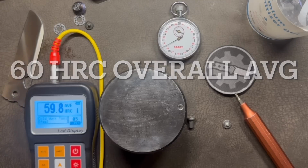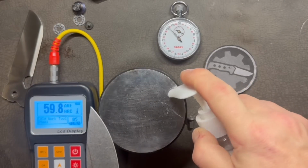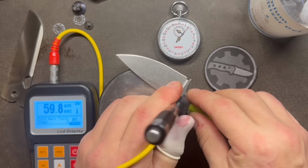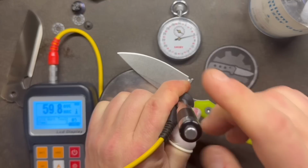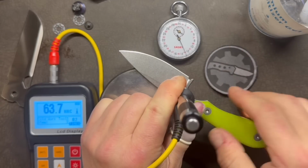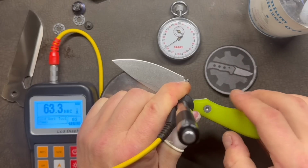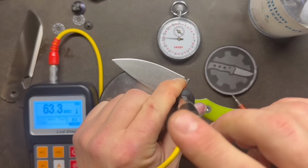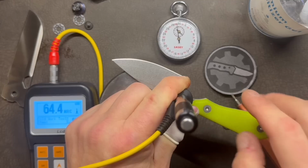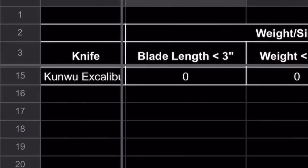And just for comparison, let's throw this White River backpacker knife on the block for the 5th or 6th time. This knife became my calibration gauge, actually, because it consistently comes between 63.5 and 65.5 HRC points. So I'm getting the same accuracy on it as I would expect from a Rockwell tester. And to that point, I will link a video in the description that shows the entire logic behind me trusting this Leeb tester. I'm not going to bore you in this video with that. All right, let's get into scoring.